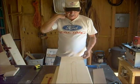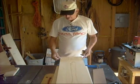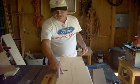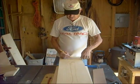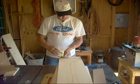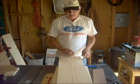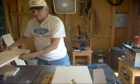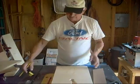So what I'm going to do is take my table saw here, and I'm going to run one edge off the board really close, then measure over 4 inches, and that's going to be a piece, and 4 inches here, a piece, and I'm just going to look and see how it lays out in the board, in case I want to move one side in from the other. Going to rip that. I'll set my fence on the table saw at 4 inches and rip them. Simple.